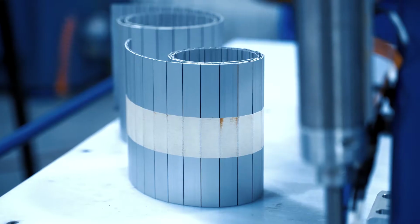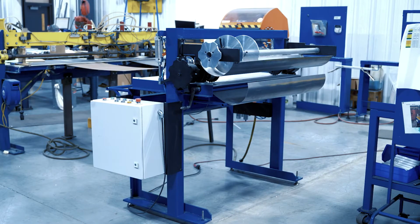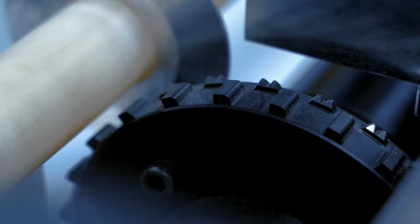15 minutes of that 1 hour was on a crimping process. That was just a machine. There's nothing that we could do to make that machine go faster. The goal was basically, we had to be able to get our labor targets down to under an hour. So I brought up an idea to the design and build team over there, and they developed a machine that could then crimp this down to under 2 minutes. When you can take 15 minutes and bring it down to 2, then that was a huge deal.